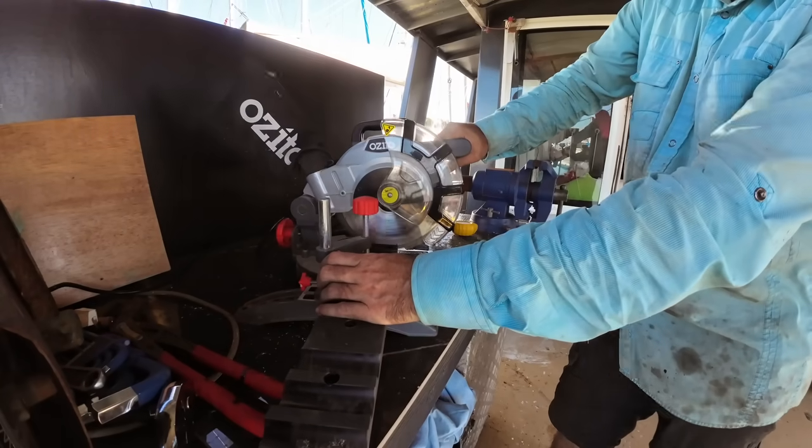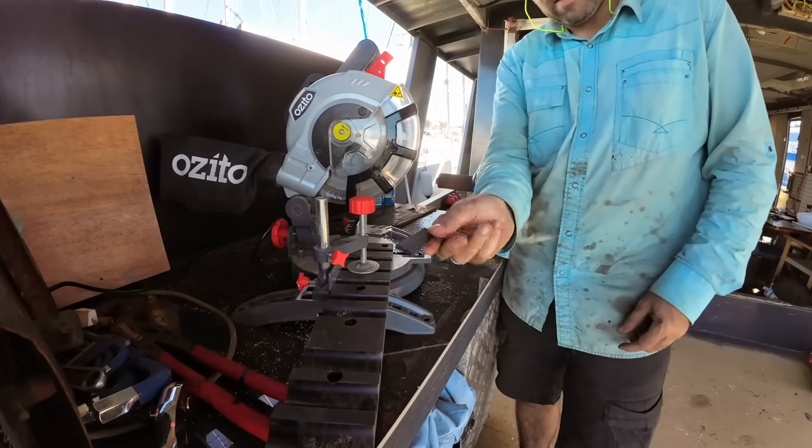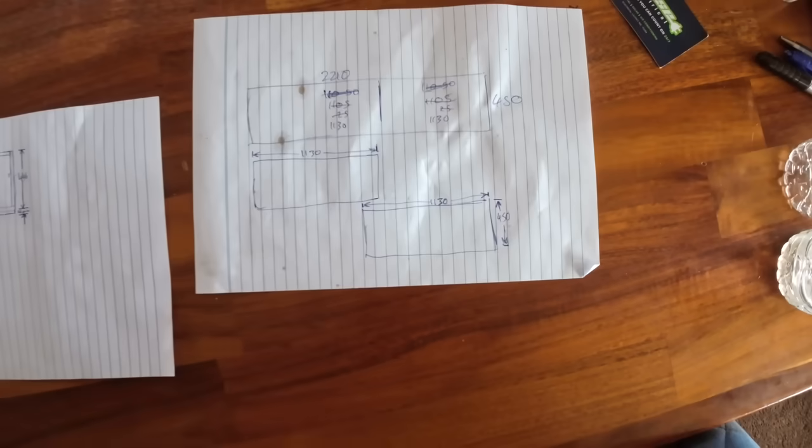I really want these doors to slide beautifully, and this stuff is fantastic for sliding things on. So I'm going to make some little tabs that the doors will sit on, and that'll allow me to slide it in that track without having stainless on stainless and having it sort of score itself and gark up all the way. Slidey block. All right, time for doors.